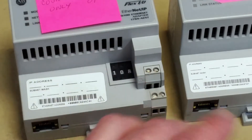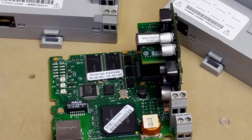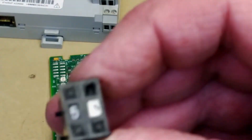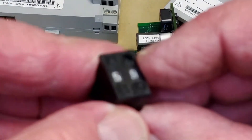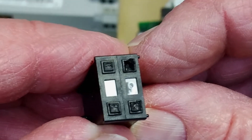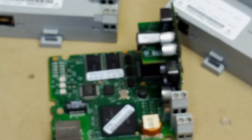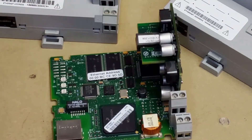It took me the better part of half an hour or so to figure out how to get it out of there. Then you have to get new switches, which I don't have right now — I've got to get them ordered from a reputable supplier and solder them back in and get them tested out. You can see at the top here where someone has used something — it looks like something hot — and really damaged that switch, so it's completely shot. Because of the way the board is, you have to take all three out at the same time.